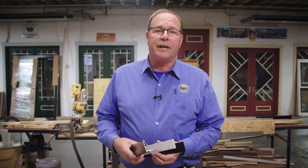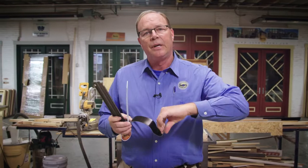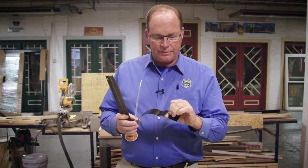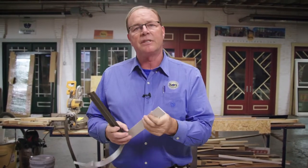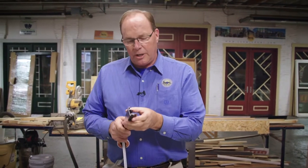Here are the three basic types of exterior cladding for wood windows and doors. We have a rolled form aluminum, which a lot of people use — it's about the thickness of a Coca-Cola can, very thin, with a very low quality finish. We also have a PVC or vinyl extrusion that a lot of companies use. And the Sun-Clad exterior is a very heavy-duty, long-lasting, durable extruded aluminum.